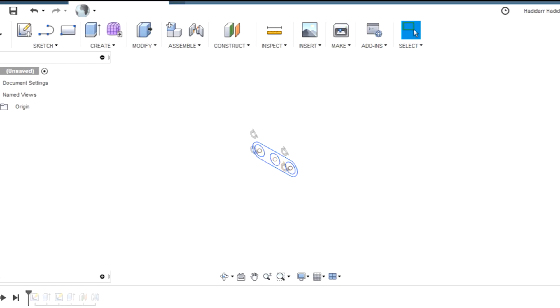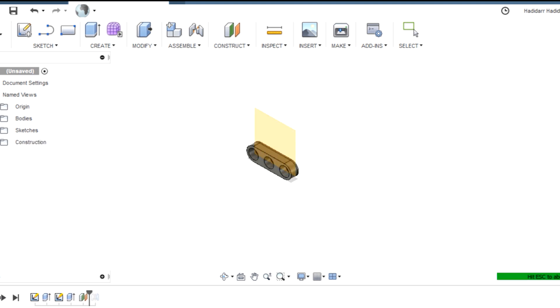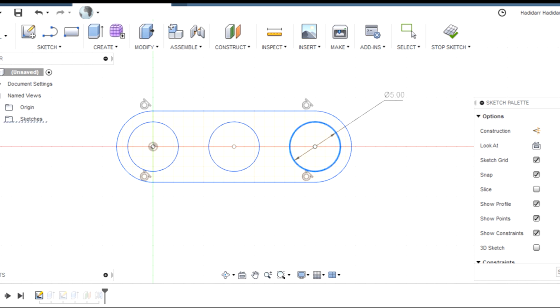That's why I cannot give you a single STL file and guarantee it will work on any printer. But I have a solution. I went to Fusion 360 and drew a Lego beam with 3 holes, printed it out, and tried it with an original Lego pin. Obviously it didn't work. So I went back to Fusion and kept adjusting the dimensions until I had the perfect grip between the pin and the printed beam. Now I have the perfect dimensions for my 3D printer.